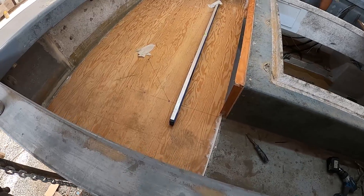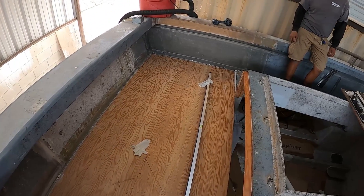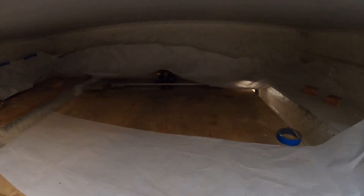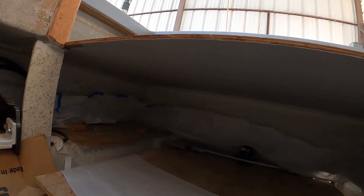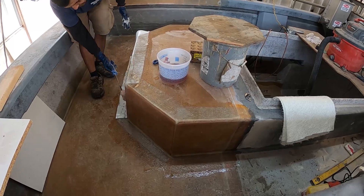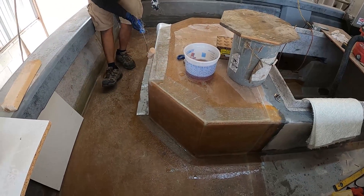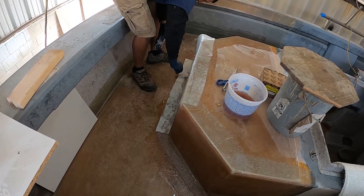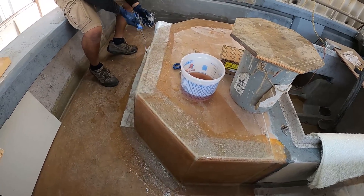Here's the first step in getting the deck down — put some marine plywood down and got it screwed. The bottom of the plywood was already glassed — they put glass on the bottom on the bench, got a couple layers of glass on there and got it gel coated. The hatch is built out of marine ply and you're laying it up with mat first, then combo, and another mat after this.